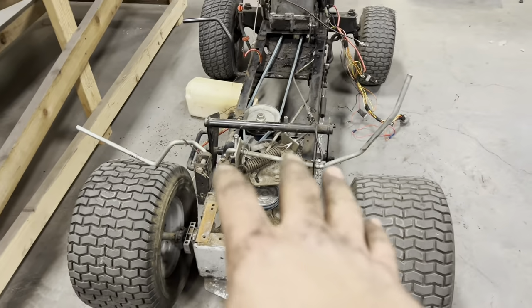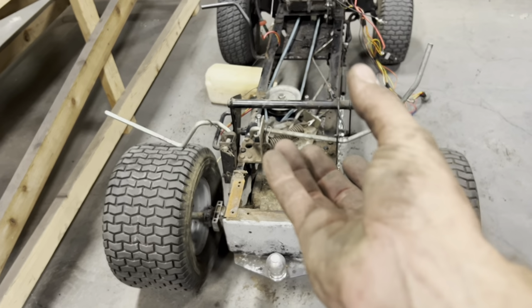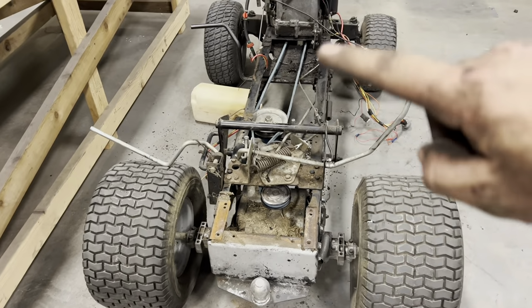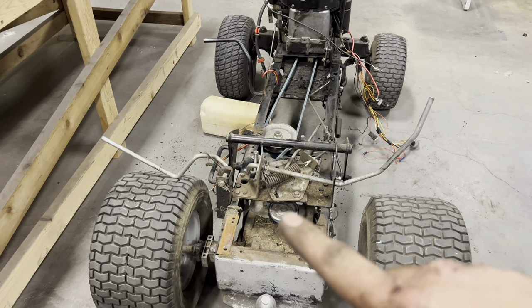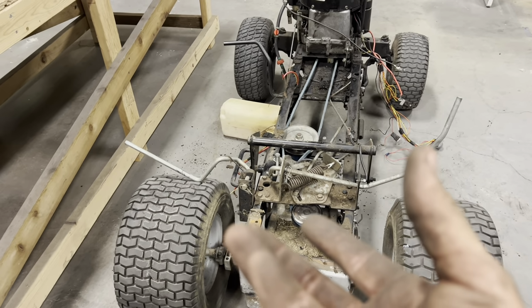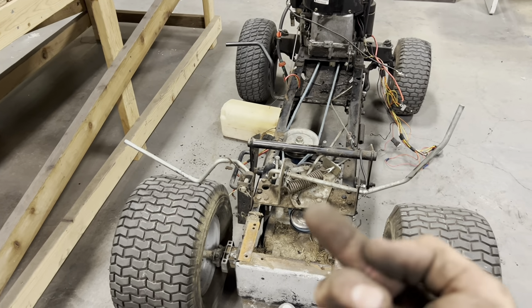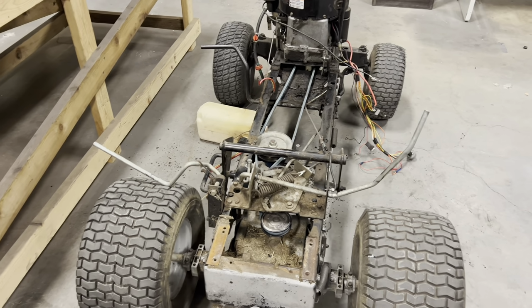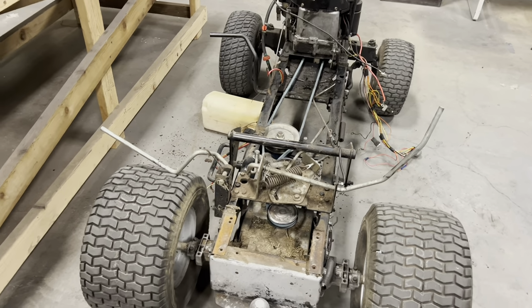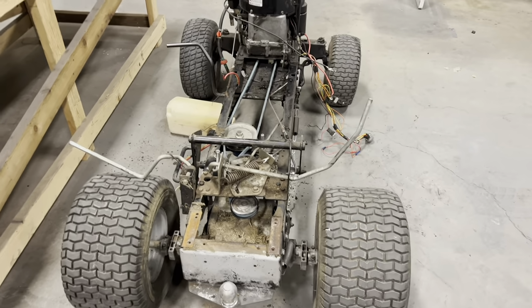The idea is to unbolt the axle, flip it around, spin it around, and then hook our belts back up and our pulley be on the same plane that it currently is, but on the underside of the axle, and spun around. That should keep our wheels turning in the same direction. We should have the same 6 forward gears, 1 reverse gear. It'll just be lower.